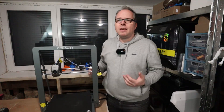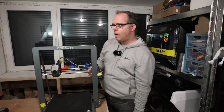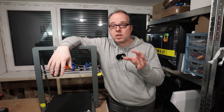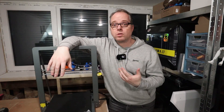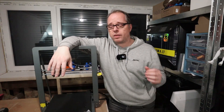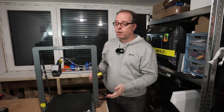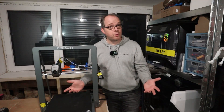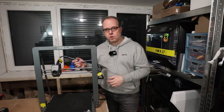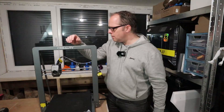Through the web interface you can drag and drop or click the plus button to send prints — it's basically a Klipper-style method. I wish Creality put more effort into making profiles not only for their own slicer but also for Prusa Slicer and Orca Slicer. Orca Slicer does have several profiles for Creality machines. I'm mainly using Orca Slicer for this printer and it runs fine, no problem whatsoever. It's a direct drive setup with a reverse Bowden tube just for guidance.